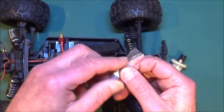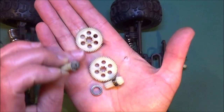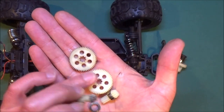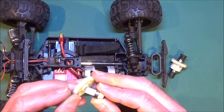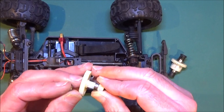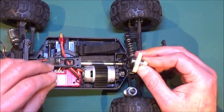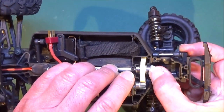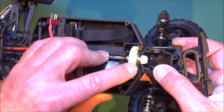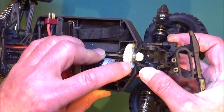So let's get that out. As you can see, there's the old bevel gear — it's exactly the same. And there are the spurs, again they're exactly the same. So let's see if these do in fact fit — I'm pretty hopeful about this. I might as well use the new bearings as well so it's all brand new again. Just push that through, put the other bearing on, and then we're going to try and get this set on the end of the prop shaft. A bit of fiddling, but we've got it in there. Make sure the bearings locate where they're supposed to and make sure it turns around nicely and smoothly, meshing up with the motor. That looks all quite good.